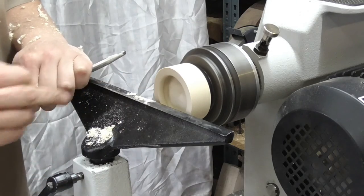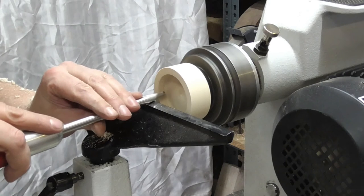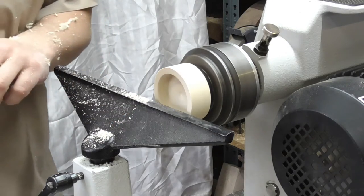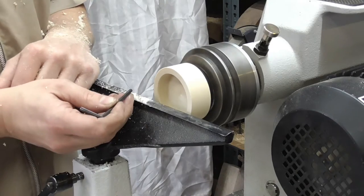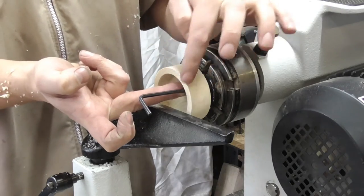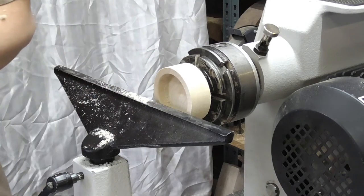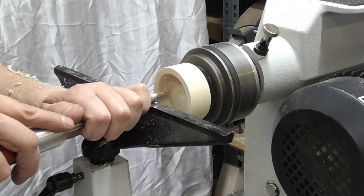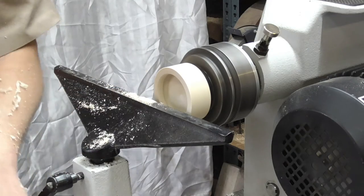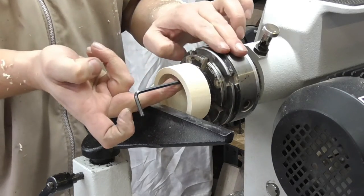Without the danger of hitting the bottom of the box. I'm just going to make sure this is nice and clean on this edge and make sure it's parallel. I'll put a little chamfer on that edge and show you a little trick to check whether it's parallel — I'm going to use an allen key. Get your finger in there, and you can actually see by looking down just how accurate you've been. It was out slightly so I made a little adjustment. Double check — yeah, that's spot-on.